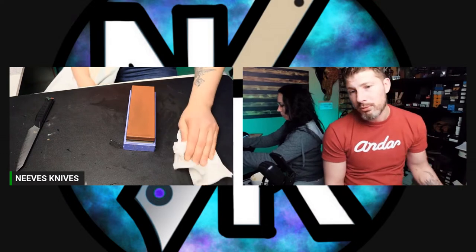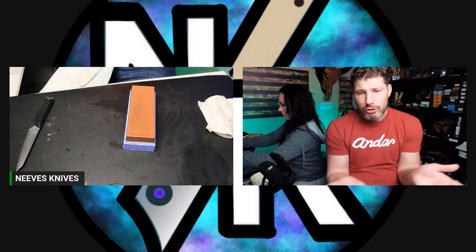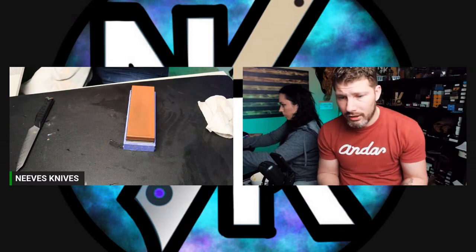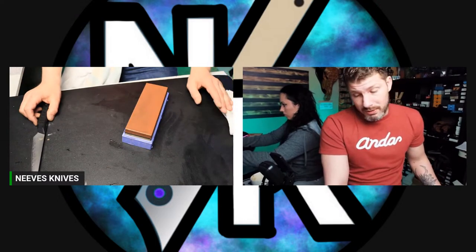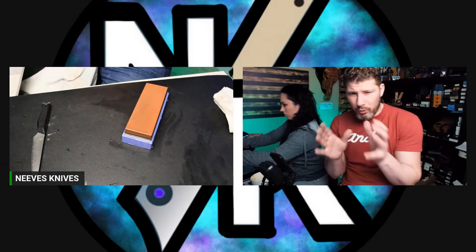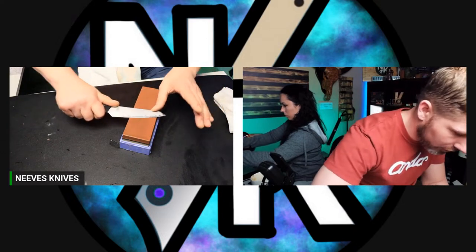But it's not optimal. What's optimal is replacing the grit and setting a new bevel, even if you keep the same angle. So if it's a 25-degree edge bevel, you can do another 25-degree edge bevel, but with your new scratch pattern and a new apex. So you're going to create a burr on both sides and knock it off. If you start at 1,000 grit, it's going to take a long time to get those scratch patterns out, because most likely your edge is a 300 grit factory edge. It's usually what factory edges are, a 300-400 grit belt, and then they strap on some sort of compound wheel, basically like a buffing wheel.